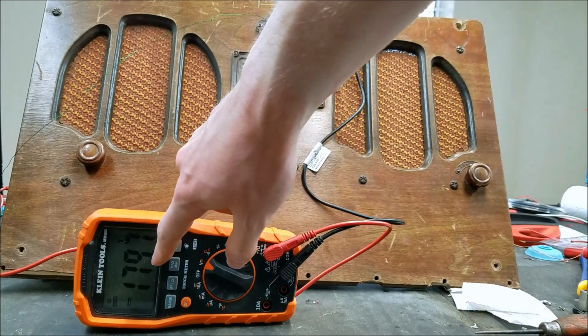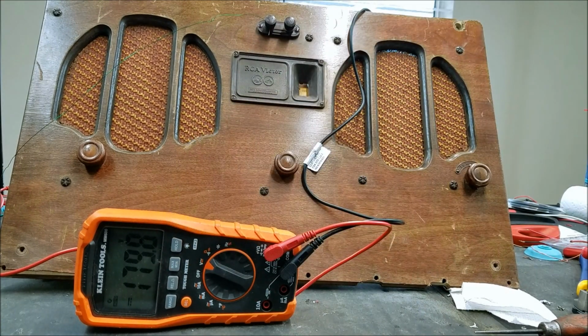They do pop back up to about 180, so I don't think we're depleting that much out of them. I think there's still a high resistance point somewhere in the string. Because I think what was happening was the faulty batteries. I think I found 3 faulty batteries in total. 2 or 3. I think that high resistance was dropping the voltage down.